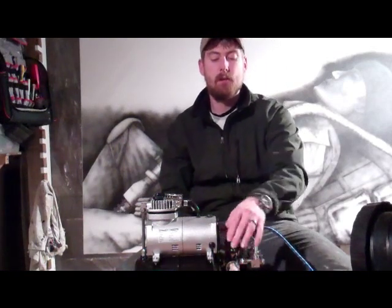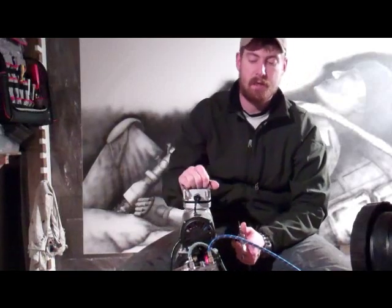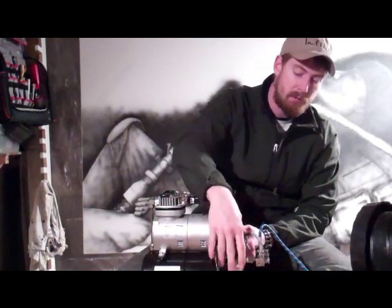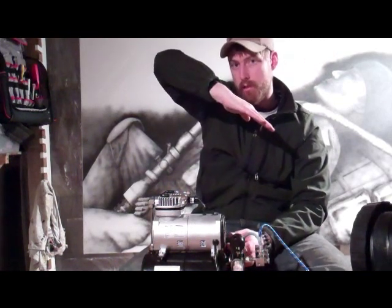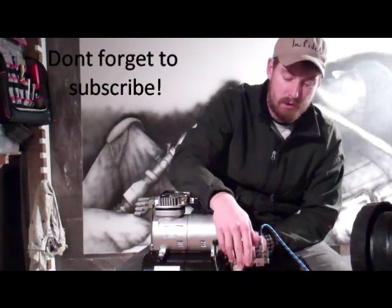Now, a lot of you will look at this and you'll see that the air trap, this water trap, is at an angle. Because otherwise it's not tight enough and you could get an air leak right here. If you have to do that, just make sure that it is still pointed somewhat downward. As long as you have that gravity effect, the water will stay in here.